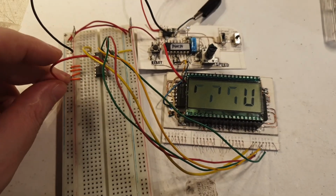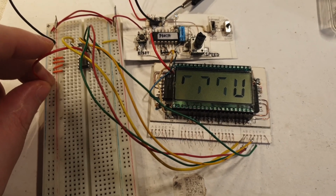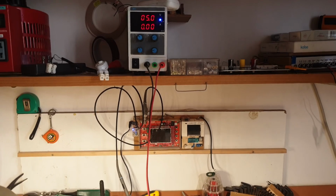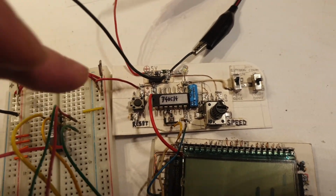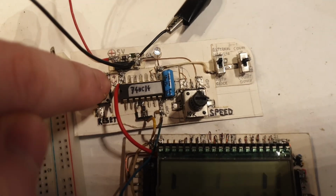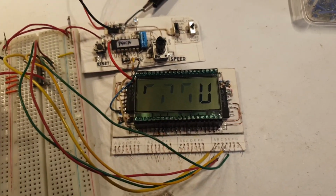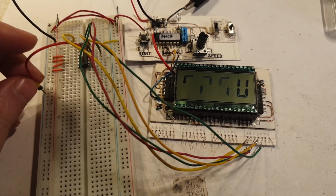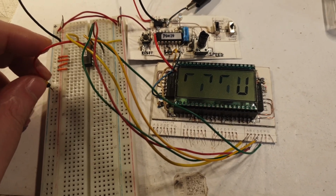And if I'm clocking from here manually, it's not working. It should have incremented. It should have displayed 1, 2, 3, 4, 5, but it's not. One thing is that I'm powering with 5 volts there, but I'm dragging the power. You see this little wire here that is going to the rail? It's actually from the 3 volts there. It says there, this is 3 volts, and all these chips are powered with 3 volts. Theoretically, it should work. If I read, it's not even 3 volts, it's 2.8. And I blame the power a little bit.